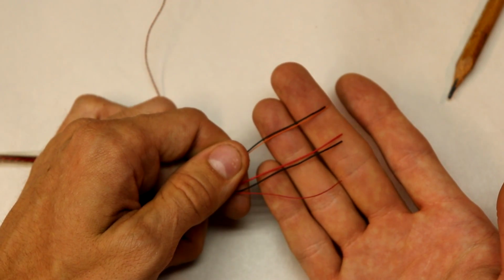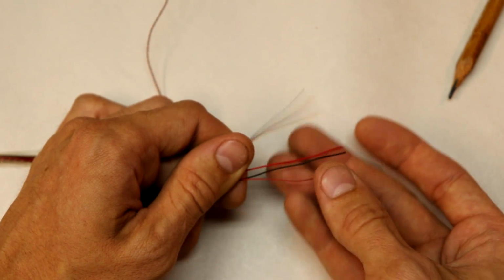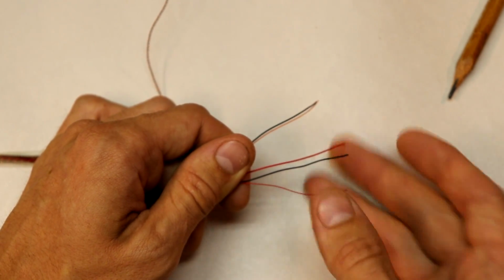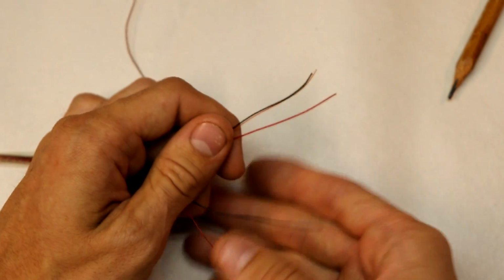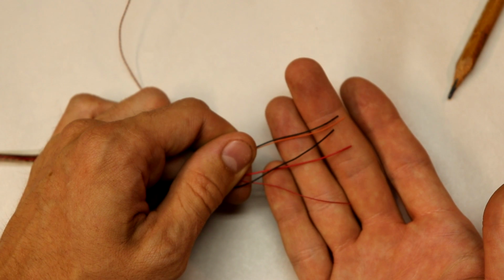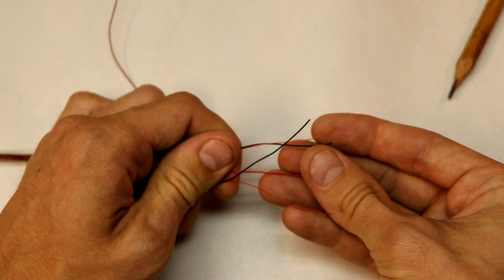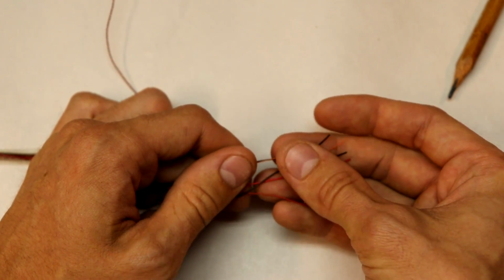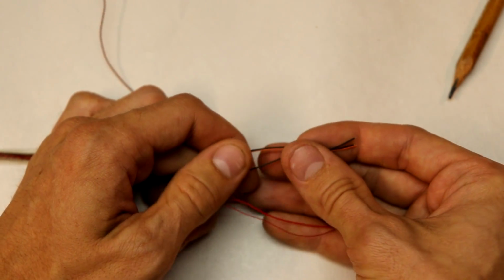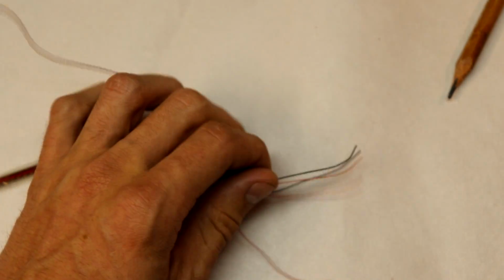So here we see two black wires, an orange wire, a red wire, and a very smaller red wire. So for USB to work, it needs two data lines, and it needs a black and red wire for power. Now we see two black wires which should be both ground, and we can test that with a continuity test.